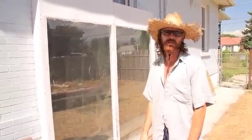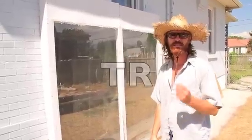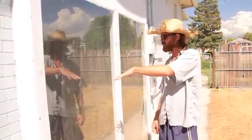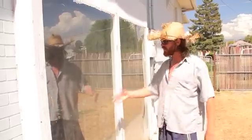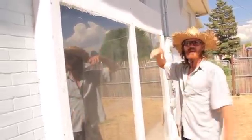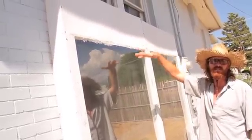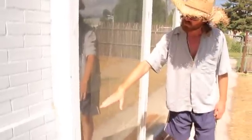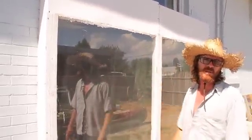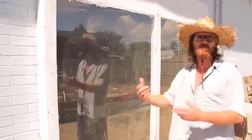Welcome to Retrofit Trombe Walls — Trombe is spelled T-R-O-M-B-E. The whole concept is that in the wintertime, the sun shines in on the southern wall. Air inside the glass box rises and goes into the house. Air in the house stratifies — coldest air sinks to the floor and is pulled through vents cut flush with the floor, returning into the solar collector. It thermosiphons all day long at about 110 degrees, blowing out pretty rapidly.